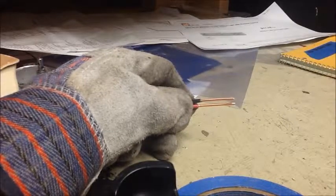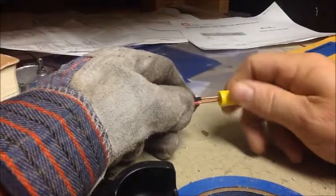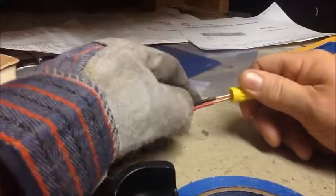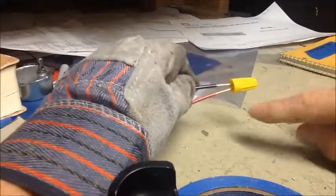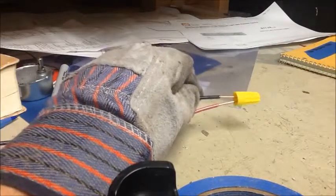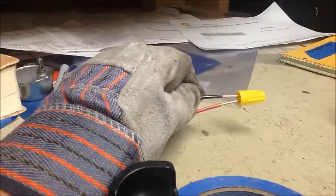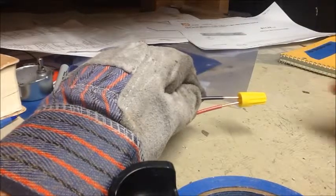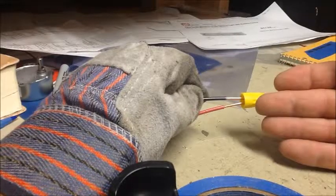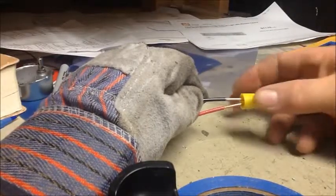Now you can see if I were to make a connection here with these two wires and just place a wire nut on it, and as I folded the wires back into the box they would have spread apart like that. You can see the gap between the bare copper. When a high current is applied, the tendency is that electricity is going to arc across those two wires, generating intense heat and causing a myriad of problems.